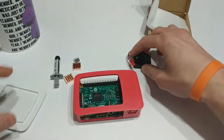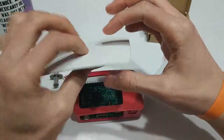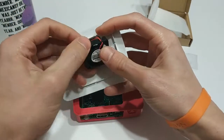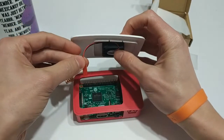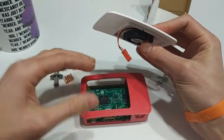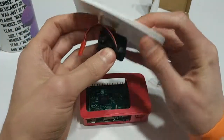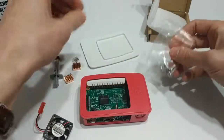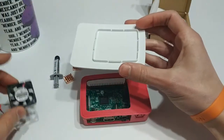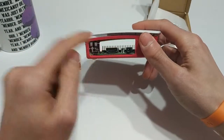What I'm going to do is affix this fan to the top of this. Normally what you would do is cut a hole in the top, but I don't really want to do that because I don't have the tools. I'm going to stick this guy on there — I'll probably flip him around like this — and obviously plug it in. When I pop the top on, I'm going to leave the sides off so that I can get some airflow through the sides as opposed to the top. In the case you get some nuts and bolts, so I'll probably drill some holes, make some marks, figure out where it's going to fit, and fix it using the nuts and bolts.